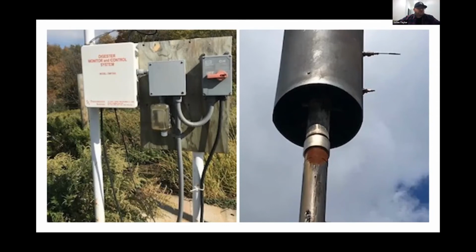We also do offer a solar system for those who would prefer it, and it's powered by solar. The technology has gotten much better through the years, where those are much more reliable systems. These systems have a thermocouple that measures temperature to tell the igniter to cut on and off, and also has a power source to get that igniter sparking to light the gas off.